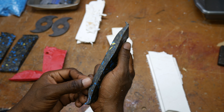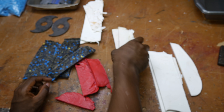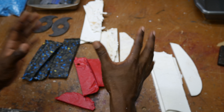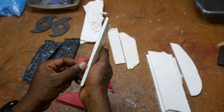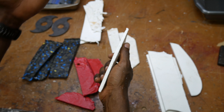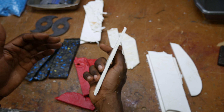Wow — well now we know why they make industrial shredders. That is beautiful. Here are my thoughts: the winners by far are the industrially shredded plastic and my dado shredder. I cannot believe that — that is shocking. But this is a preliminary test and I think some of this is practice. What I'm going to do is take my dado shredder, put the blades back together, get rid of the spaces and shift up the table to the top so that it cuts more like a table saw with the blade coming towards the plastic instead of grabbing it and pulling it away. I think that's going to be the safest and most effective design, so I'm going to put a little more effort into the shredder.